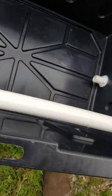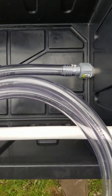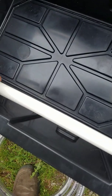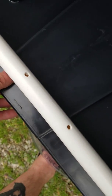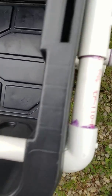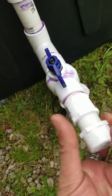For my filling and draining system, I'll take this hose with this spigot adapter and actually screw that onto the pump feed, then throw the hose in the lake. That will pull water into the pump and up through this line and out these water lines, where I've drilled some quarter-inch holes down through it so it can spray water back in to circulate and aerate.